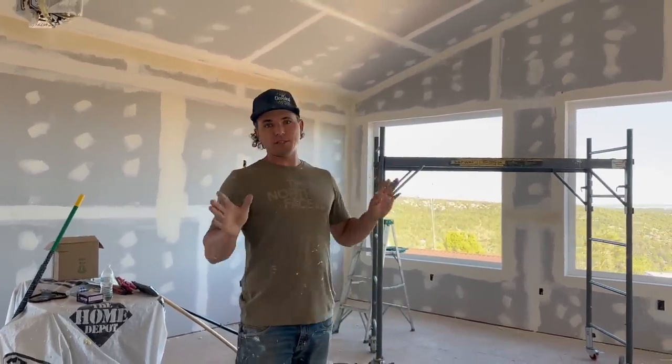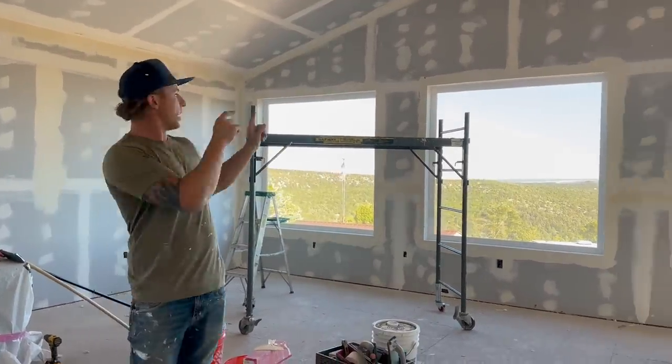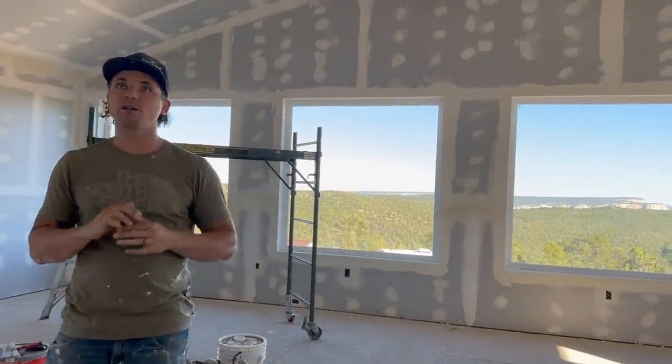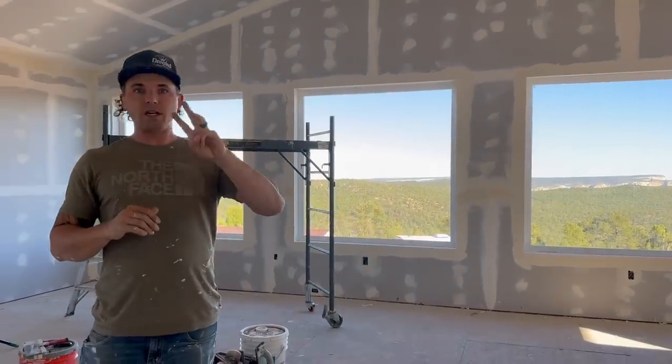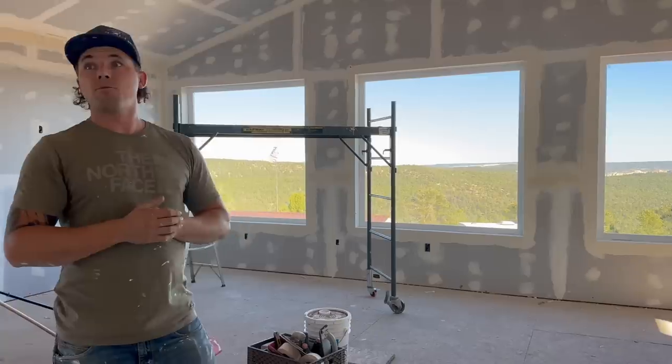It's going good - we got quite a bit done but we ran out of drywall mud today. We've been through 12 boxes of drywall mud and we have 10 more coming today - the in-laws are bringing them. That should finish us up. We're on our second coat, about halfway done. We still have to do the ceiling and a couple walls, plus the bedrooms and bathroom. We're planning three coats total, so after sanding this one we'll do one more, sand it, and then we should be able to texture with maybe a little touch-up here and there. I'm going on five or six days straight, sun up to sundown.